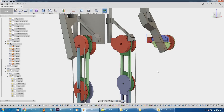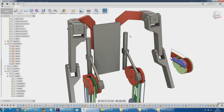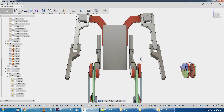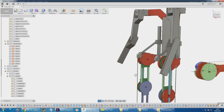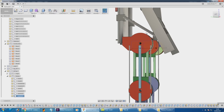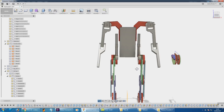We're going to take some parts off the other suit, but we need to make the hip assembly, which are these red parts. My uprights here — these poles and these slanty pieces — are coming off the Mark 1 suit, but we've got several degrees of rotation here. We've got rotation around this axis, the legs rotate as well, and also rotation around those towers. So that's three axes at the hip.